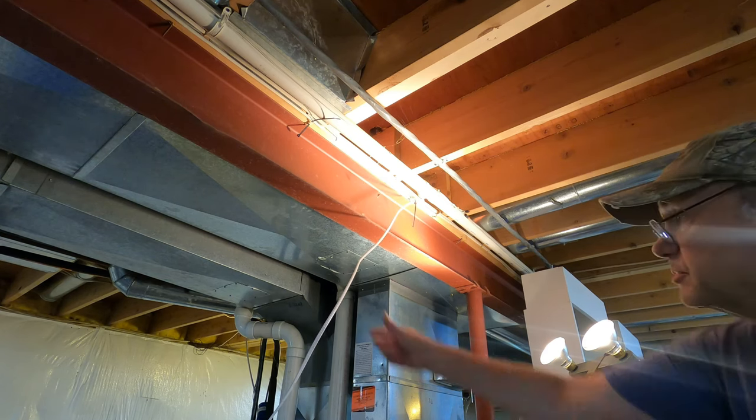So now let's look at the contact wiring. The way I originally wired this thing, I put my 120 volt hot source on the common and had it going across the contact out to the motor, as you can see here. Well, it turns out that's dangerous, and I had to change it. Because when the relay is not energized, this contact's open, so the motor stops. But this contact is normally closed, so it's energized all the way through to the end of this wire, which comes pre-stripped and exposed from the factory.